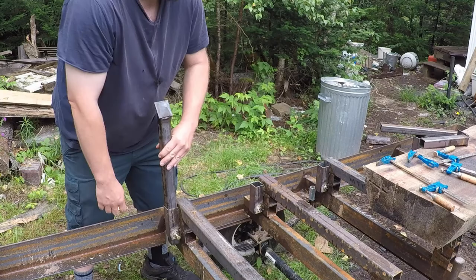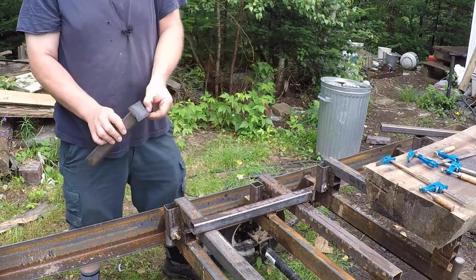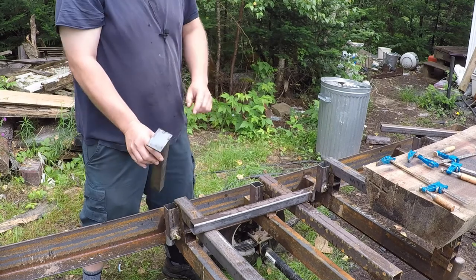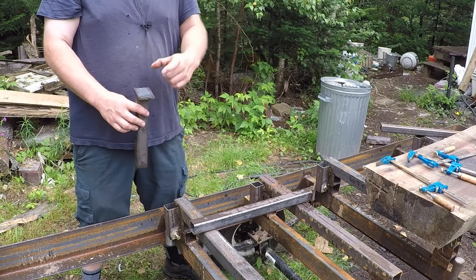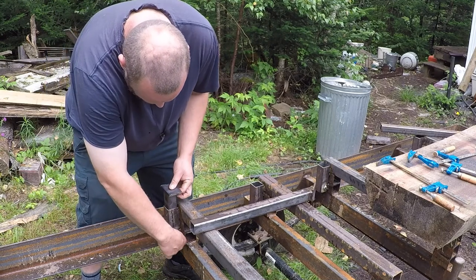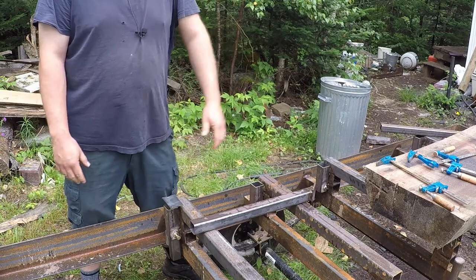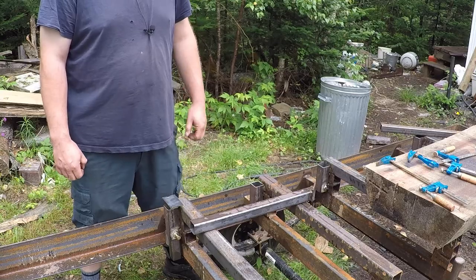I tighten that better. And when we're cutting cants, we've got these. This is just a piece of 1.5 inch square tube with 2 by 1/4 flat bar. I think they're 3 inches long. Drop it down, you can get way down and get just the bottom edge of the cant, and squeeze it up against it. So now we got to make the clamp side of the dogs.